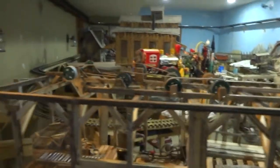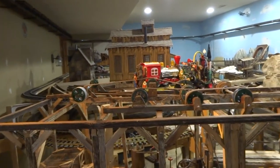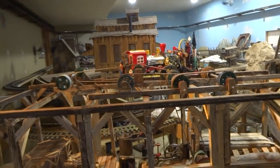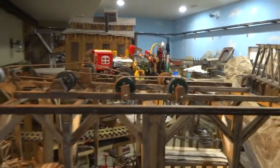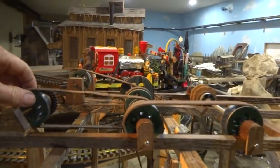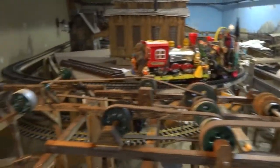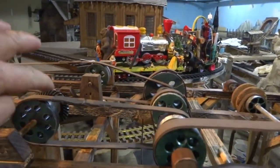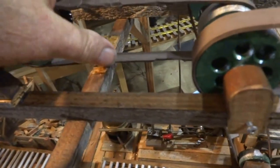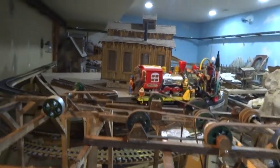I just want to give you a little update as to what I'm doing. If you're going to attempt something like this, I found some great material that works for a belt — it's kind of spongy rubber, so it has little air holes in it that make it suction-grip, which is great because plastic wheels and steel wheels slip an awful lot. You can barely have any tension on them. All these are all wood, and all you've got to do is grab just about any one of them and they'll all spin. But they don't come long enough, so naturally I've got to piece it together. And then what I do is I sand the edges off if I know they're going to hit somewhere. Like right here, I put a piece of smooth plastic there so that the belt would run real good over it. As you get going on something like this, you learn all the tricks of it.